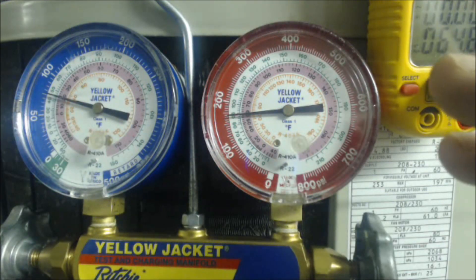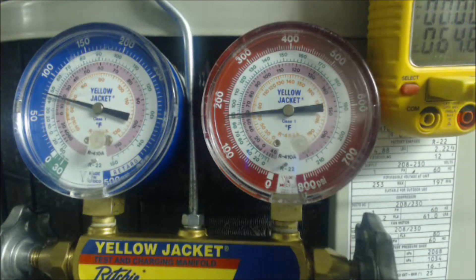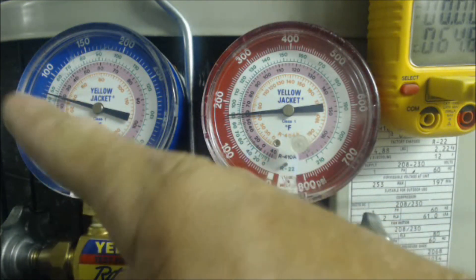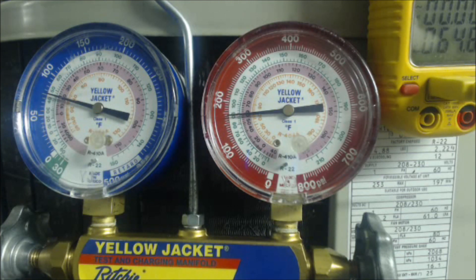Especially when you're this close — within 4 or 5 degrees of superheat — only add a little bit of refrigerant and give it time, because this temperature will start to fall rapidly. At 75–76 PSIG with a 46-degree saturated temperature, we'd be looking for 61 degrees on the vapor line to hit 15 degrees of superheat. I like to get the superheat reading very close to target, within about 2 degrees. For subcooling you can be within 3 degrees plus or minus, but for superheat working with a fixed orifice, stay closer.